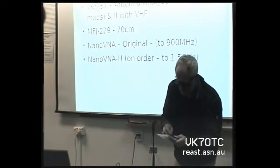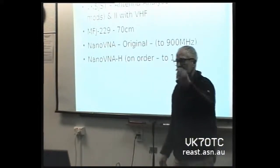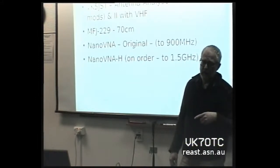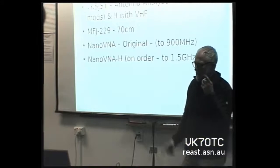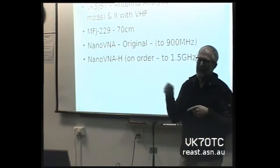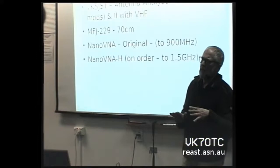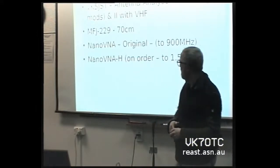But anyway, you're welcome to. Hang on, I'll switch it on. Touchscreen. Your Smith chart, it'll plot on a Smith chart if you want it to. It's got the calibration kit in there that came with it. If you want to get into antenna analysing cheaply, you can't go past it. The only thing is, you need magnifiers on, you've probably got too fat fingers to push the buttons, but you get used to using it. And the only experience I've had using it outside is, if there's any sun, forget it. You've got to get into a little cover to use it. Okay. Any questions?